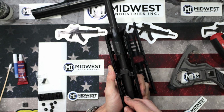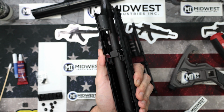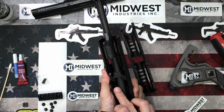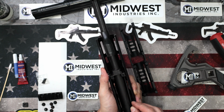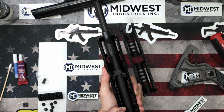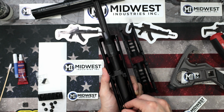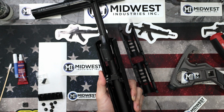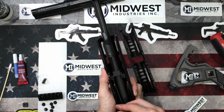I feel like I'm stripping the screw away a little bit. Yep, stripping the screw away. So the round tip is no longer as round as it once was, so maybe the Vibratite from the beginning was a bad idea, guys. That's why you should always follow instructions. I did use Vibratite, and either the set screw is stripped or the tool is stripped. So the set screw is working. I can unscrew it, but I do know that it does feel stripped. Okay, so make sure you use Loctite.